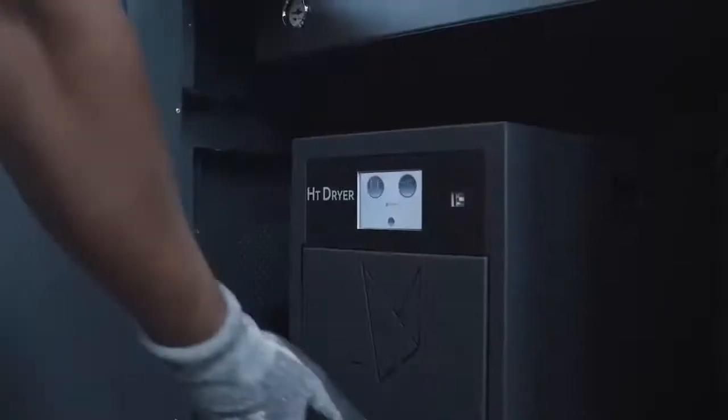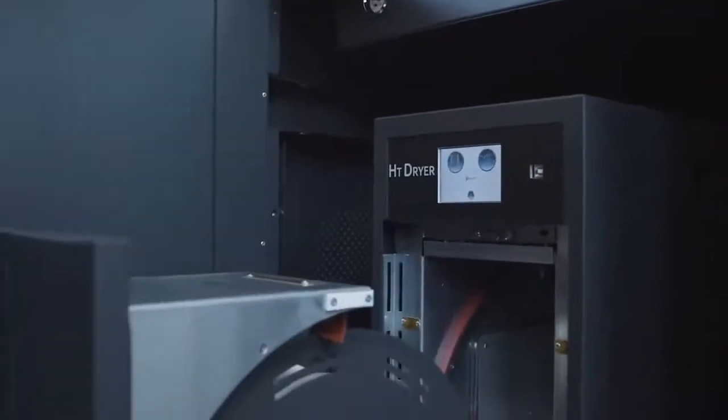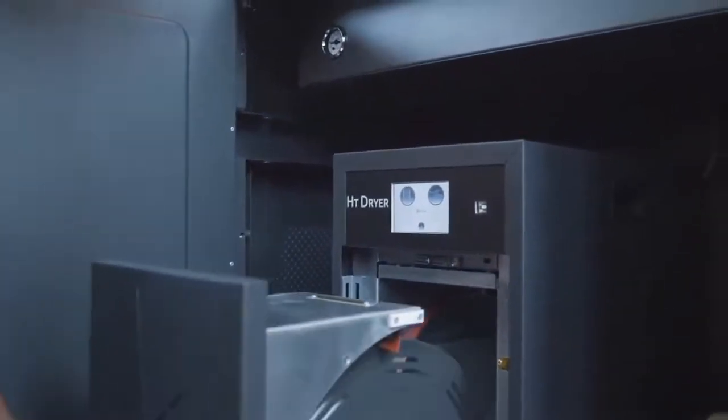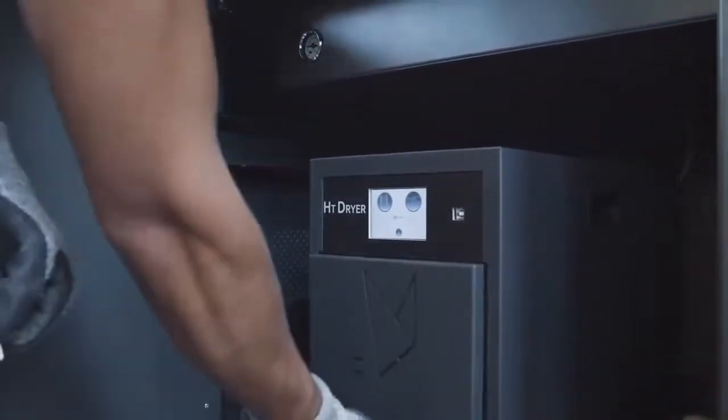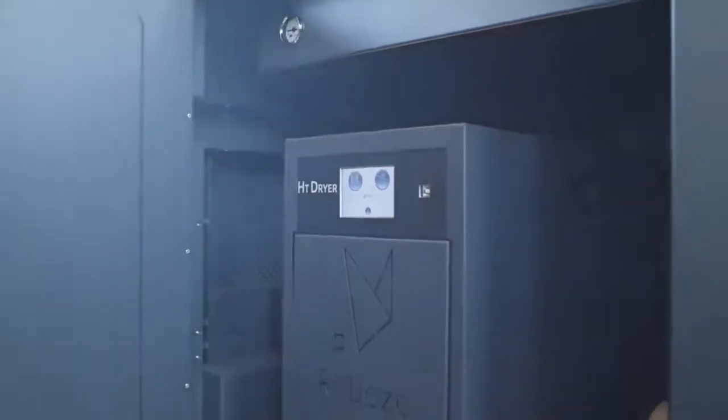The Roboze One+400 Xtreme is equipped with a materials drying system. The HT filament dryer is a device designed to dry the filaments and keep their properties in a reliable way during the entire 3D printing process. The system completely integrates into our printers, enabling automatic loading of the filament and controlled with end-of-filament sensors. The result is faster, high-quality prints and reduced time during the pre-printing phase.